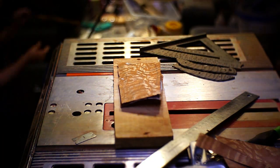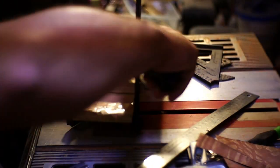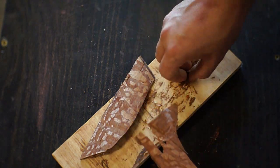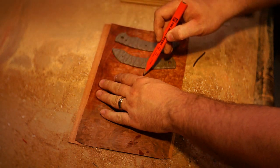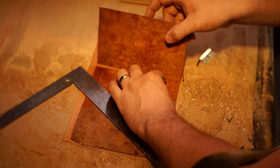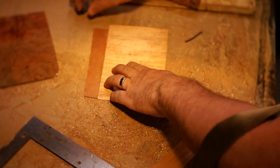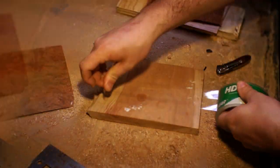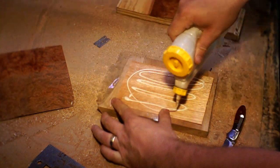So I made a pretty big misstep here — see if you guys can spot it while I'm gluing it together and clamping it up. If you asked yourself why I didn't put packing tape on both sides of the wood when I clamped it together, you'd be right. It's really kind of sad because I've been looking forward to using that veneer for quite a while. Enough glue squeezed out through the veneer that it just glued itself to the other side. So it's back to the drawing board — I found another piece and this time I'm using packing tape on all sides.